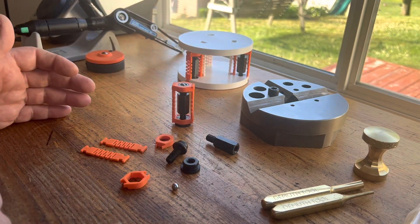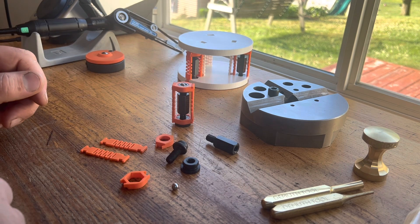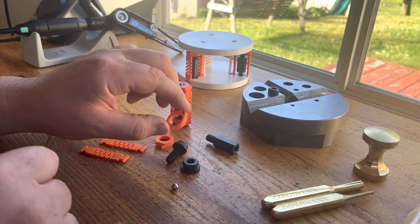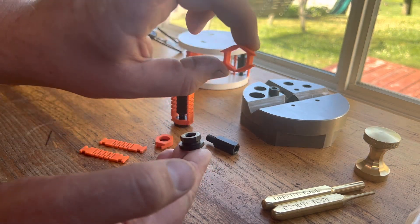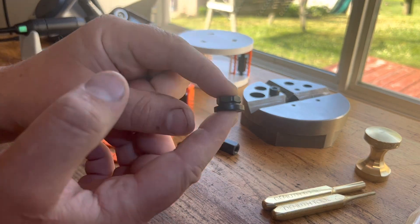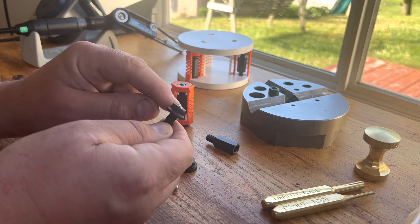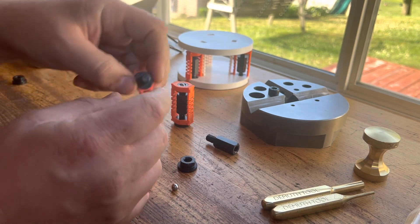That's a pretty decent resolution for what I'm doing, and I wanted to figure out a good way to do it with printing — and this is what I came up with. We have a lower mount which clips onto the hex. As you can see, there's a little protrusion on the flats, and it clips into the undercut on the nut. Then the upper mount takes advantage of the knurling on the flange screw, and it just press-fits together.